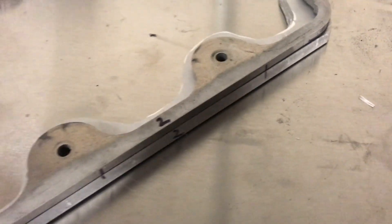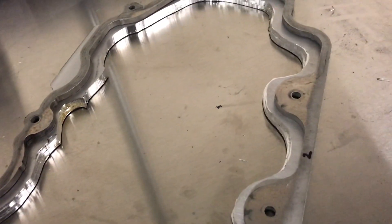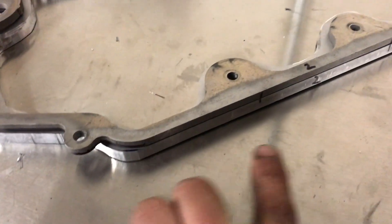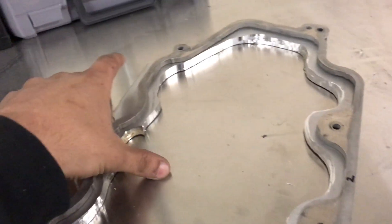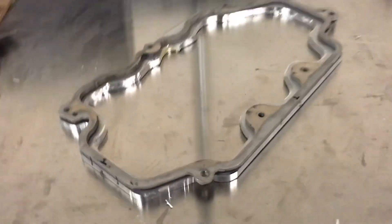It's a little big in spots, probably like that everywhere besides marks one and two, which are my guides to make sure I'm keeping the same shape as I cut. Everything's pretty much trimmed up as much as I could — I'm happy with that. What I'm going to do now is take it to the welder, have them tack a little bead here and there so this thing doesn't move, then go back with everything on the table and cut out very precisely where it ends. That should give me a perfect match.